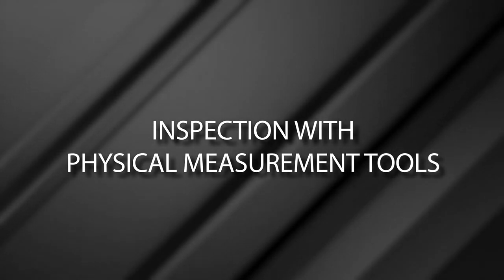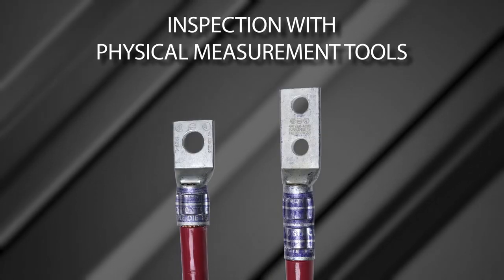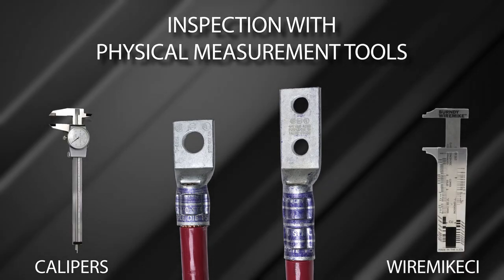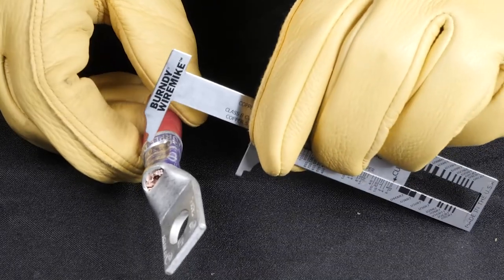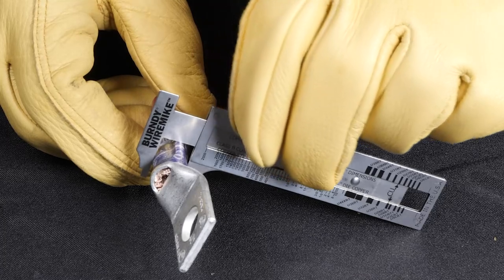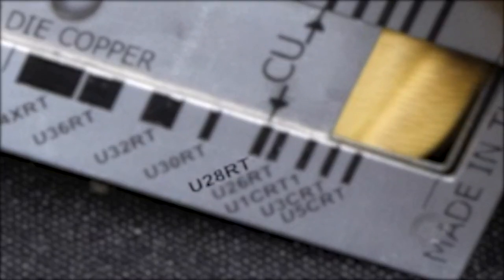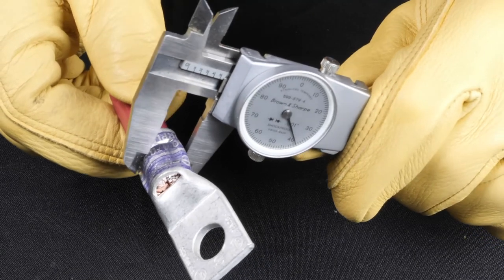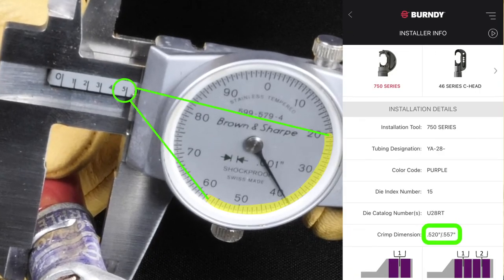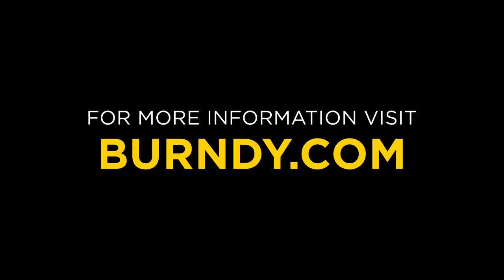Inspection with Physical Measurement Tools: Physical inspection of a crimp can be done with the use of the Wire Mic CI or calipers. The Wire Mic CI can be used as a U-die post-crimp measurement tool. Place the Wire Mic on the crimp, read the die catalog number indicated on the tool, and verify that die catalog number with the die used based on the die index number and color code. The Burndy Connect app provides the post-crimp dimension range. Place calipers on the crimp and verify the readings fall within the proper post-crimp dimensions. This concludes the copper code terminal installation training video.